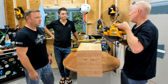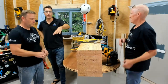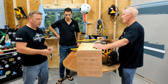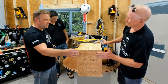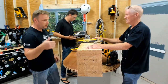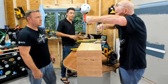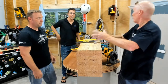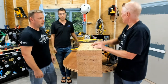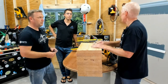On the 18-inch beam cutter, to cut 18 inches it requires a worm drive saw. You could tell — if it was a smaller motor maybe it wouldn't have cut that, because you're talking about cutting through an awful lot of material. When you're going through 18 inches, that's going to be a slower pull-through. I wasn't having to muscle it. If you've ever seen a guy use one of those big 16-inch circular saws, they've got to put their whole body on it and they'll kick back on you — there's no kickback at all with this. I saw you were putting pressure on there just with your thumb — just the guidance, just a little guidance to make it easier to control.